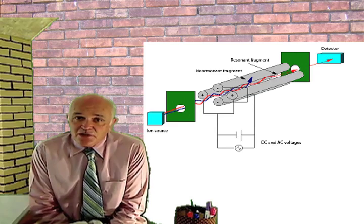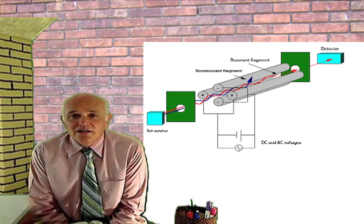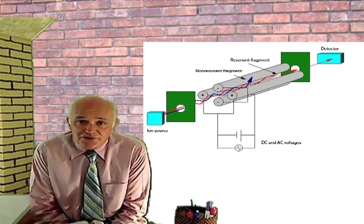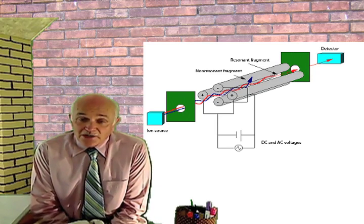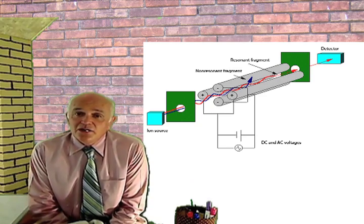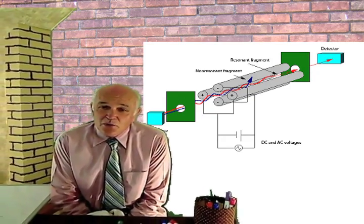One problem that comes up in mass spectroscopy is that mass assignments sometimes aren't quite right and the DFTPP won't pass. As the ions go into the filter, they either go through or they crash into the quadrupole and become part of it. Over time the quadrupole picks up secondary charges from the radio frequencies involved and doesn't work well anymore. You have to wash it — take it out, use green sandpaper to sand it down a little, spray it with methylene chloride, treat it gently, and put it back in. For a production mass spec this should be done maybe every three months; for a research mass spec, maybe never.